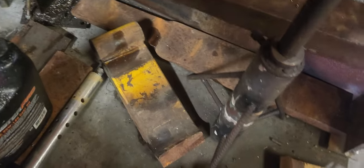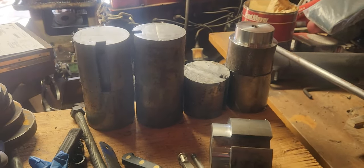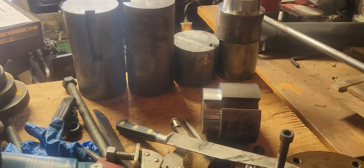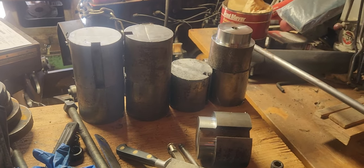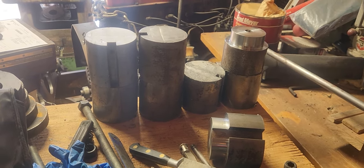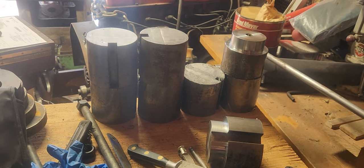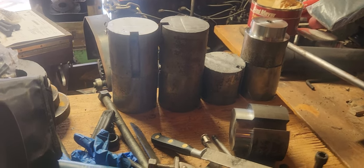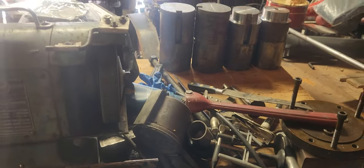Luckily a good chunk is solid without the keyway, but for these - actually 16 pieces since this is only one side - the keyway is going to be an issue. That is how I solved the roller problem. I considered using aluminum, solid rubber wheels, and even just straight slides using the C-channel directly on the track chain with a solid guide. But I decided it was worth it to machine out these rollers and do it properly. Here's an unmolested overarm - don't be sad about these being cut up; they're living another life as something more useful.